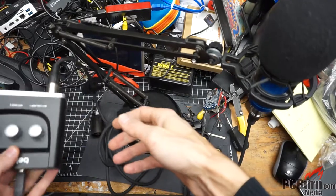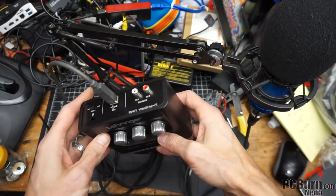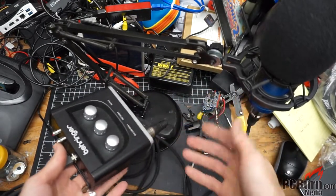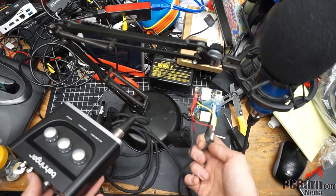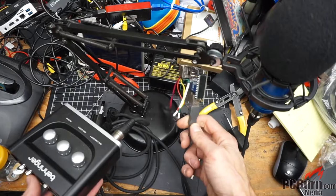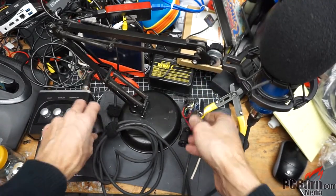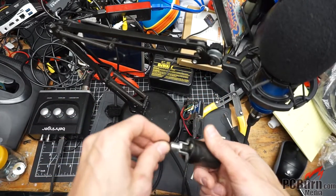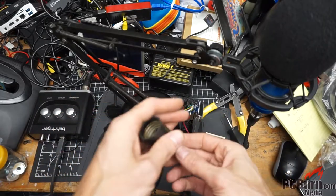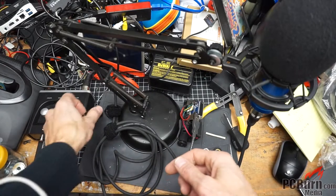The audio equipment I'm using to drive the microphone is a 48-volt phantom-powered Behringer UM2. This actually works really well and surprisingly there's no problem injecting the 48 volts off USB from the little Orange Pi Zero. I've run it quite a few times to test it out and did one piece of recording for a friend who needed to do some recording for a commercial video, and it worked fine — no issue. Audio came out pretty crisp, we checked it out, no issue.